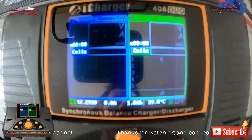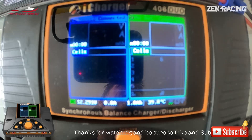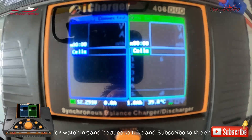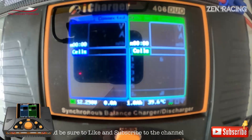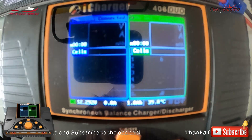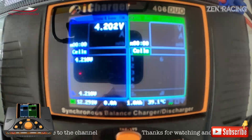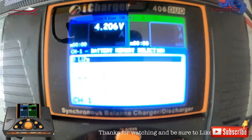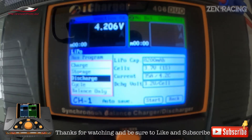Let me move the camera down to the charger itself to make it a little easier to see. I've got my GoPro sitting on top — hopefully you can see the left and right ports of the charger. What I've done is charged up one of the LiPos fully. I'm going to use the port on the left-hand side, the blue port, as the discharge port. I'll plug the LiPo in and pop it into a LiPo sac.